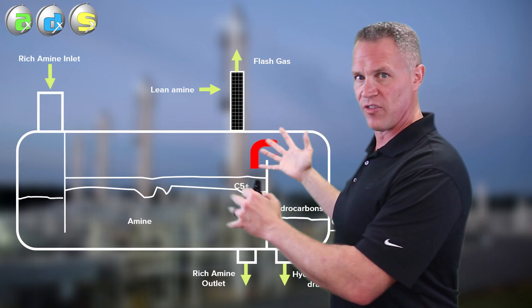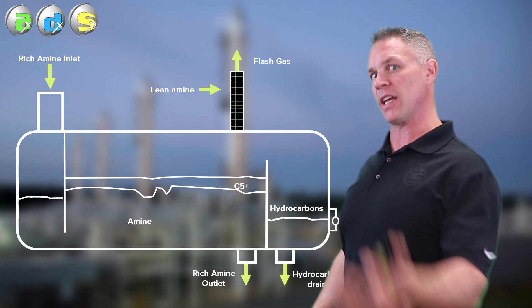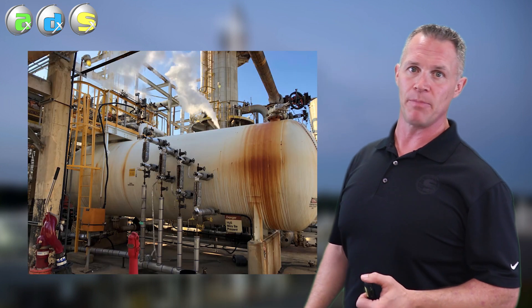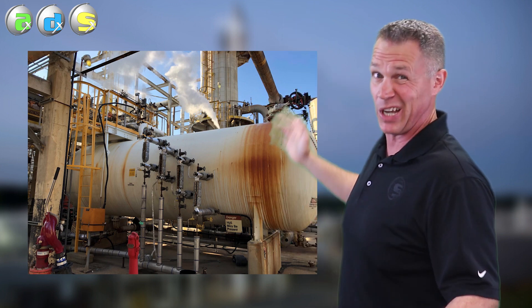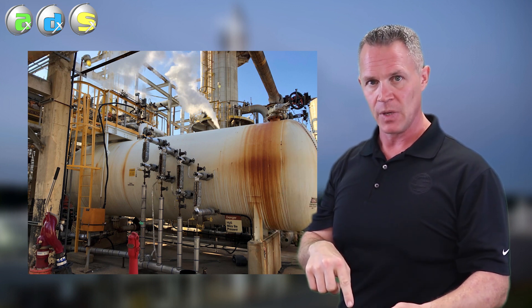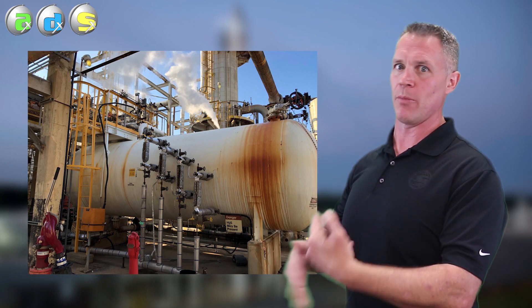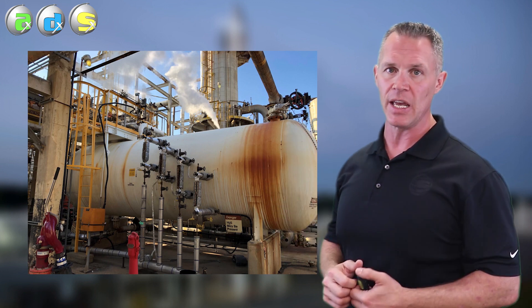It is far better to be able to sample what you are skimming. Some designs where hydrocarbons flow over a weir and automatically dump can be dangerous — it's very easy to spill amine overhead and you never really know, dumping all that amine out with your skimmings. A better design is what our friends at PBF Paulsboro Refinery use. They have no weirs in their flash tank — it's a big drum with sight glasses where you can see where the hydrocarbon level is, and you can manually skim each one and take samples. The only disadvantage is it's hard to automate, but from a troubleshooting point of view, we love designs where you can sample your skimmings.